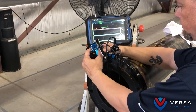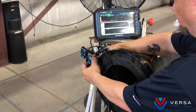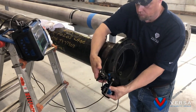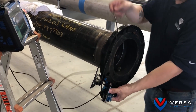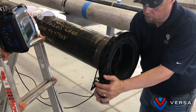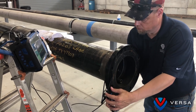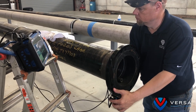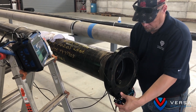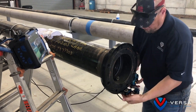Technique C requires scanning from the outside diameter of the flange. Typical setup includes a probe with a zero degree wedge, specialized scanner cart, and a capable operator. Data is collected and analyzed in an unmerged format. Coverage is limited due to the bolt holes and limits the operator's ability to achieve 100% coverage. Corrosion can be analyzed using ASCAN, BSCAN, and CSCAN data; however, this technique cannot give accurate information when measuring length and width when bolt hole areas interfere. Difficulty in quantifying the amount of damage will be realized. The probability of detection for this method is between 51 and 84% respectively.